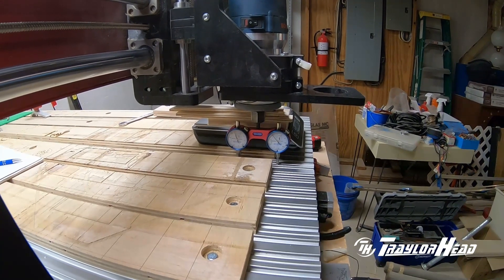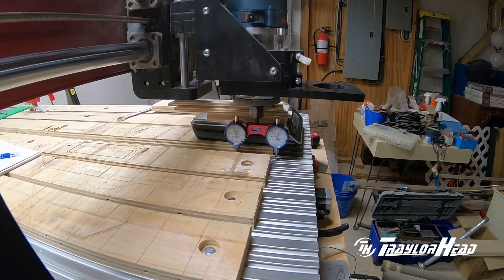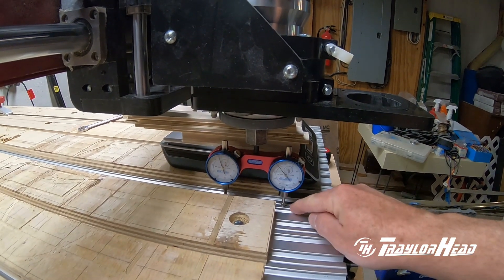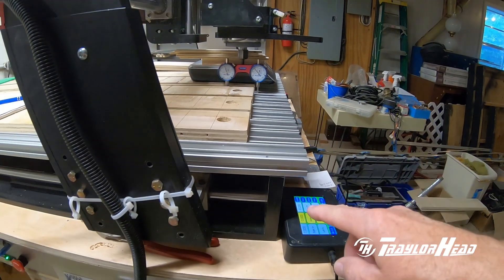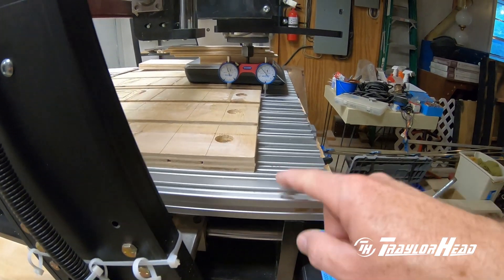What we're going to be doing is measuring the deflection of the HD4 gantry by using my dial indicator. I have it set up on the bed so it's just touching the bed but not showing any movement. I have it on the very end of the bed, which is the stiffest part — it should be the flattest.